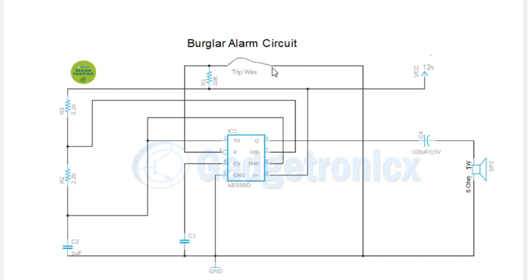This whole circuit is constructed around a 555 timer IC, and it works as an astable multivibrator. An astable multivibrator is a vibrator capable of generating a pulse signal at the output — something like this. So it is capable of generating square wave pulses at the output. That's what an astable multivibrator does.